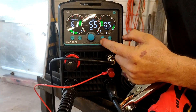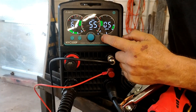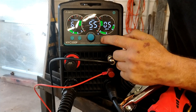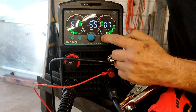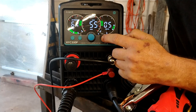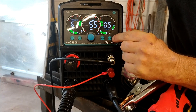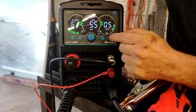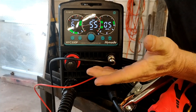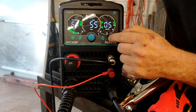This button here says 'Unit' — that's where you can adjust your post-time airflow and your pre-flow. It says pilot arc on the label but it's actually pre-flow. And this one that says 'Metal' lets you select plate or a setting for mesh or expanded metal.